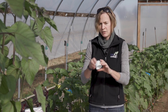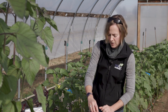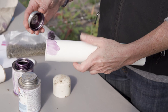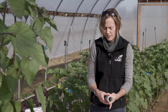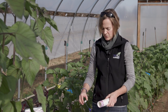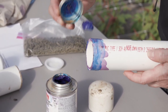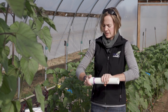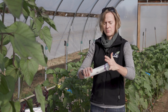If you're using the different type of PVC cap, you're going to need to use primer and apply it along the top of the PVC cap and let it dry for a few moments. After which, you're going to use PVC cement and apply that along the edge where your cap is going to go. Then you simply push the cap on, make sure it's snug, and let it dry for 15 minutes to a couple of hours to make sure it's a secure fit.